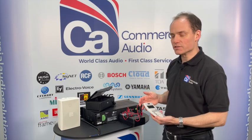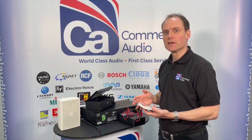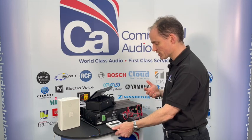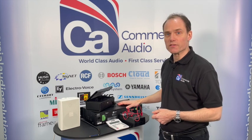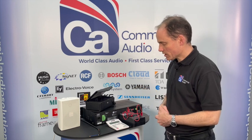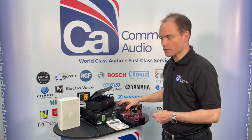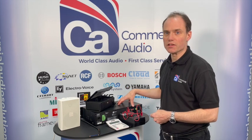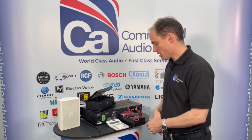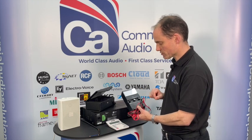With regards to accuracy, you're going to be getting something within 5, maybe even 10 per cent. But it gives you a very good reading that's a good guide to working out what amplifiers you need on systems - for example if you're replacing an amplifier that's being overloaded. Another thing to consider is to allow 20 per cent headroom in an amplifier, so if you've got 120 watts of load, you might want an amplifier which is 150 watts just to cover you. And one important thing before we go: when you're finished with the meter, make sure you switch it off so the batteries don't run down.